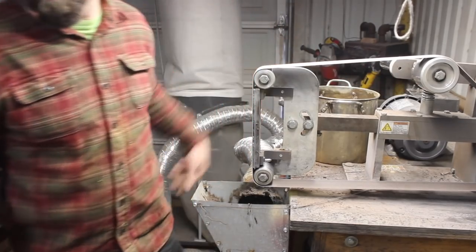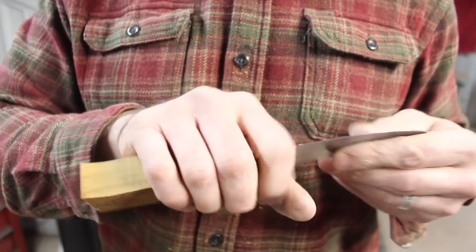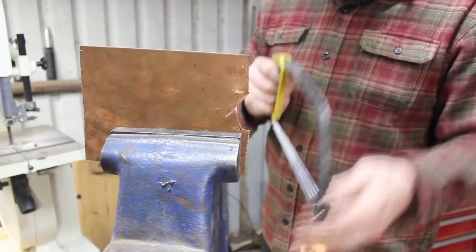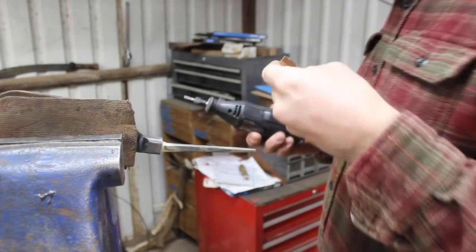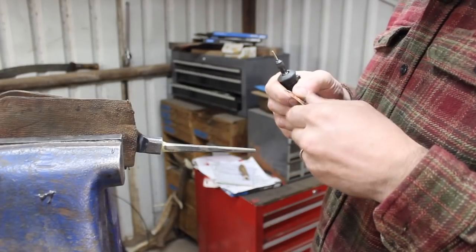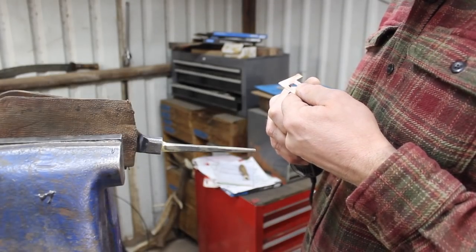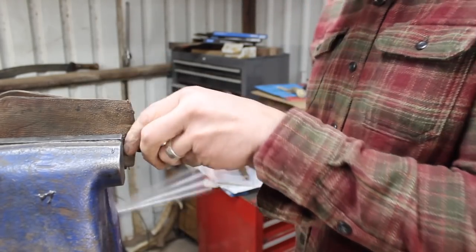This time around, I had some dry ice on hand because I had to do a couple of stainless AEBL blades, for which a sub-zero quench is necessary. So I thought, let me try 52100 — I'd found some round stock and bought a couple of pieces. Basically, this is me trying to make a good blade from 52100. The next time I do this, I'm going to eliminate the dry ice quench and keep everything else the same, to see if we're there.